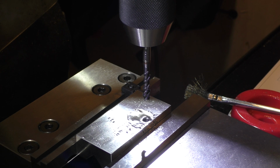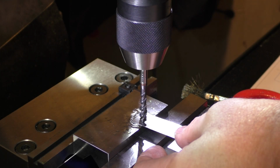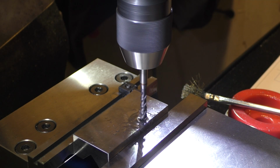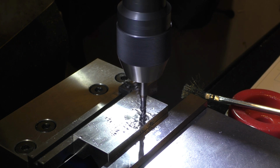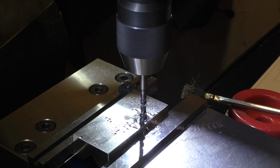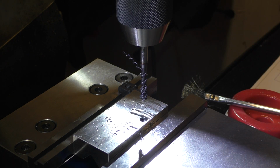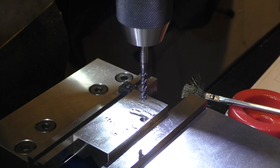All right, so we're going to try something I've never tried before. We're going to power tap a blind hole. I set my 0 on the DRO, so I went 725 thousandths down, so around 680 I'm going to stop. Oh, it's stuck anyways. Well, let's clean out the chips and we'll see if we can get the last bit. We stopped at about 450 thousandths.